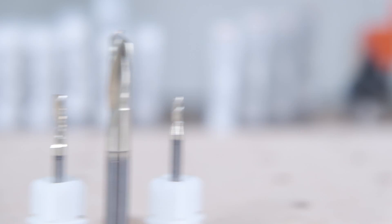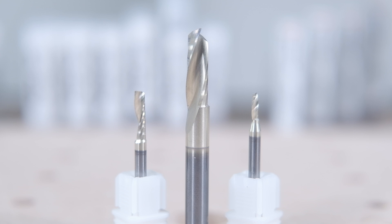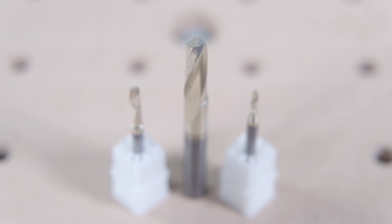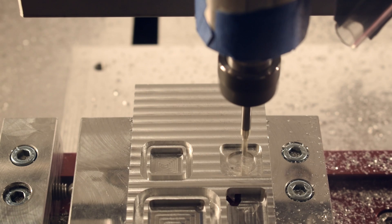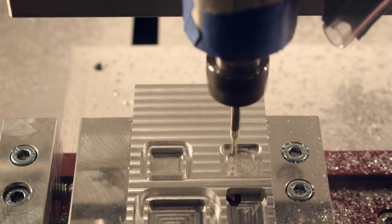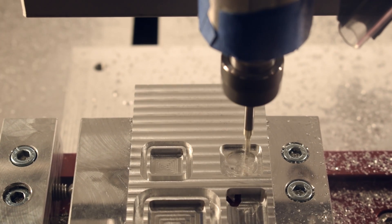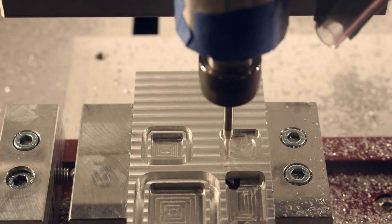Another thing that can help improve your aluminum machining is to use single flute end mills. Instead of having two or three smaller cutting flutes, these end mills only have one larger flute. This gives chips ample room to pass out of the cutting zone and further improves your odds of completing a cut without clogging your end mill. Single flute end mills also reduce torque requirements on the spindle, since the end mill is making half or a third the number of slices per second into your stock for a given RPM — really good news for lightweight machines like the Nomad.